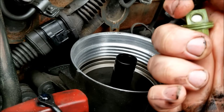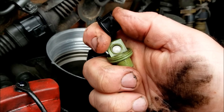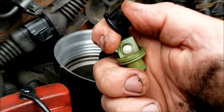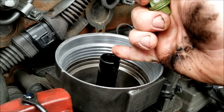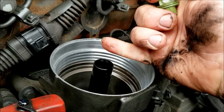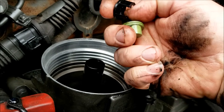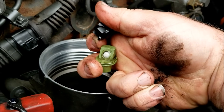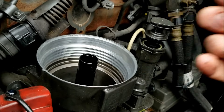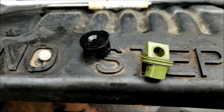Hopefully that helps somebody out. Now what PACCAR is saying is they're recommending taking the ball completely out and leaving it out. The reason why they put that ball in there is because they don't want you to put the wrong micron filter in — if it calls for a 10-micron and you put a 25-micron in, the ball is supposed to close off that port so it won't run until you put the correct filter back in. But they're having horrible issues with these check balls, and they used to have a service kit — they discontinued the service kit — so now they're telling everybody just to take the ball out and leave it.